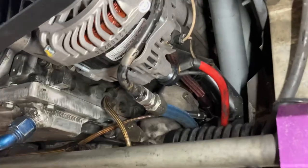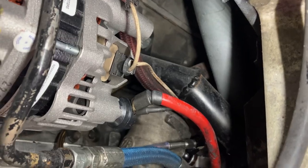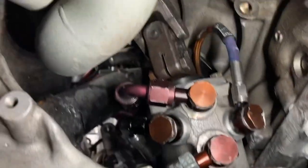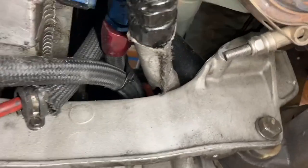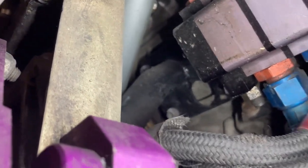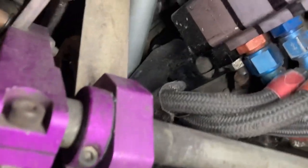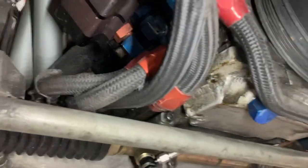One of the first things is I did go with solid engine mounts. You can see that black pipe back there — it's made out of roll bar tubing. I've got solid engine mounts on both sides, which has been working out quite well. The painted black mount mounts on the factory location on the cross member and then onto the LS mounting points, and it's pretty much the same on the other side.